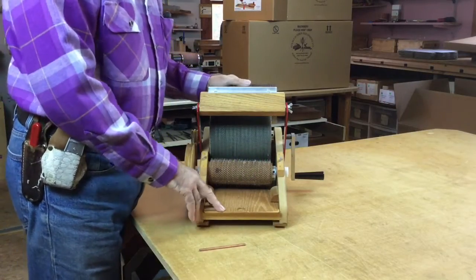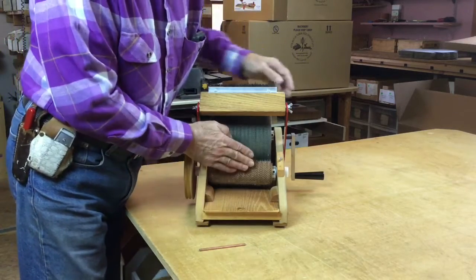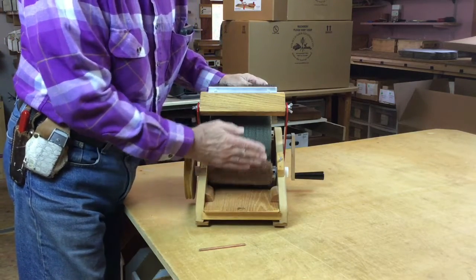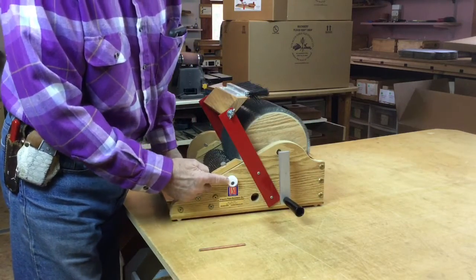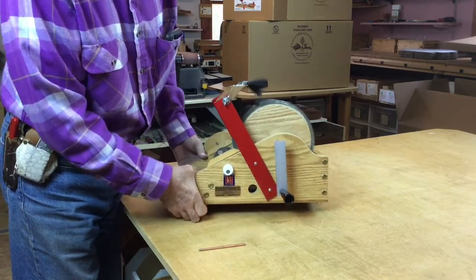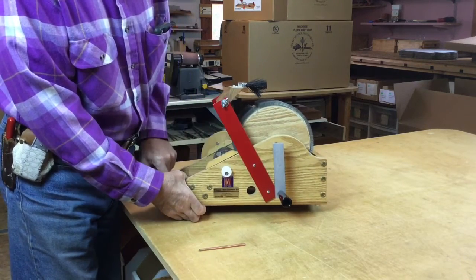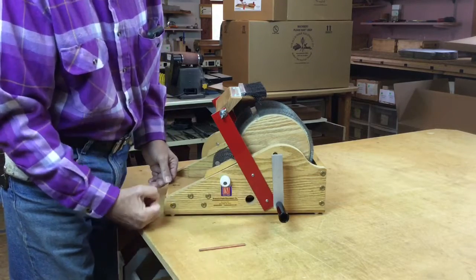Adjusting the spacing on a petite really is quite easy. It's done by moving the small drum in and out, and that's done by virtue of these bearing blocks. You notice the bearing blocks — the hole that the drum goes through is a little off-center. So by turning this, you're moving the drum back and forth.